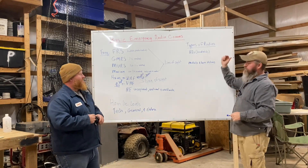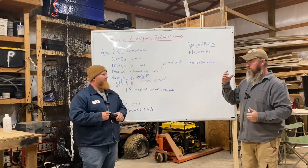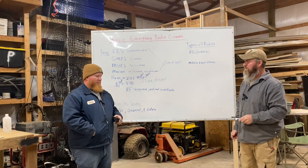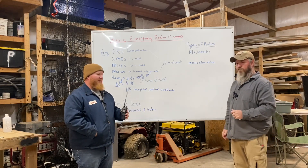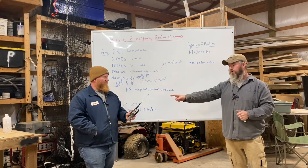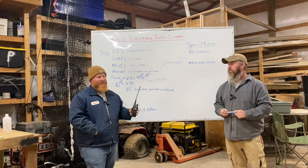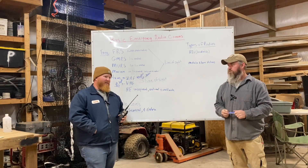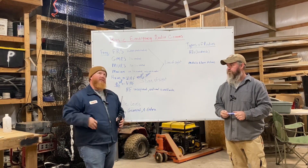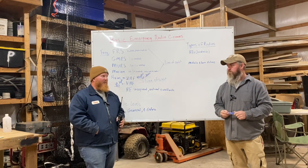You've got different types of radios. Handheld HTs like the Baofeng have limited antennas and limited power — the highest I've seen is about 10 watts. You can put a bigger antenna like a J-pole on it, but if there's not enough power to push the signal it doesn't matter much. My base station pushes 50 watts with an antenna at about 52 feet up with a quad — that gets you some real distance.